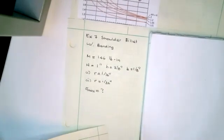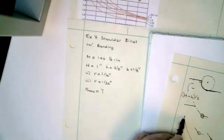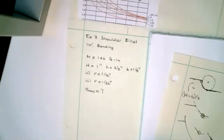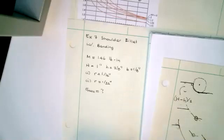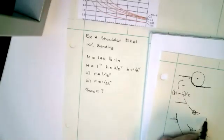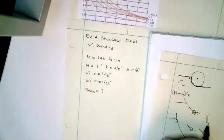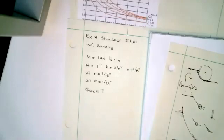And I'm assuming that top corner doesn't matter as much. As it turns out, it doesn't. It's a wee bit tricky, but when this top corner comes out like this, this is called a reentrant corner, okay? This is called a proud corner, and so this one doesn't matter, okay? In engineering, there are some engineers who get confused about that. They think all sharp corners are bad. No, some of them don't matter. This one doesn't matter, but this one does, okay? The extreme version of this sharp corner is a crack. Like that, okay. And cracks are where things fail. That's a sharp corner right there. But we will talk more about that.